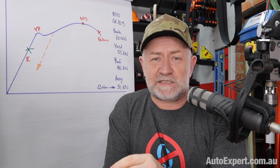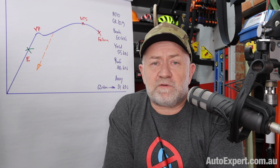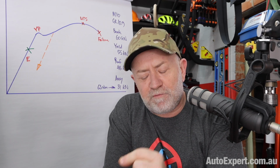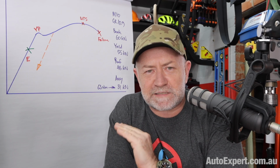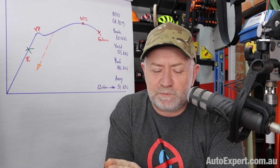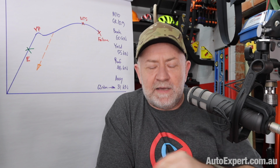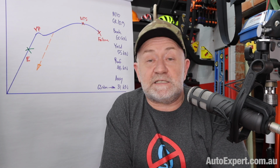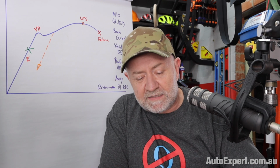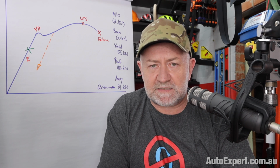And I hope that gives you some insight into the way various engineering executions take place. You might use strain gauges in environments like sending a spacecraft to Mars, where every gram counts, and you've got to make the bolts so efficient. They've got to be contributing all they can do, because if it's 1 gram heavier than it should be, that's a pain, and you need kilos more fuel to get it up into orbit or whatever. Okay, but this is not the case with cars. We're just rebuilding engines here, which is not exactly rocket science. So torque wrenches do a fine job. Angle tightening is more precise, all right?